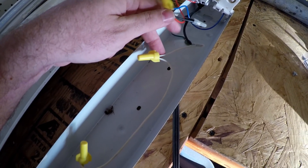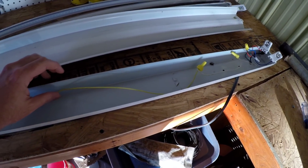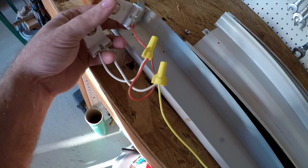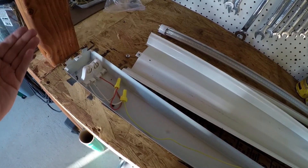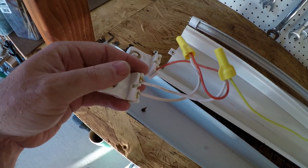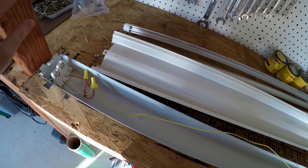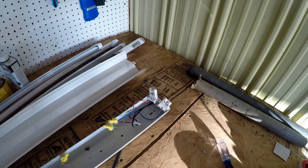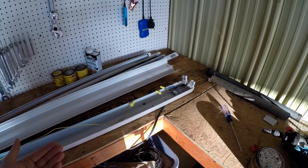The white neutral comes in and has two wire nuts on it, going all the way down to the other side powering both tombstones on that end. Now, some tombstones are different — this one has wires going to each side of it. For wiring like this it doesn't really matter because we're using this end as negative and this end as positive. Where it matters is if you buy bulbs made to be used without the ballast.